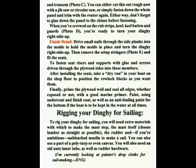There will still be a little excess left over since there is an angle to the side planks and the laminate trimmer trims at 90 degrees. A little work with a plane and/or belt sander, however, will fair this up.